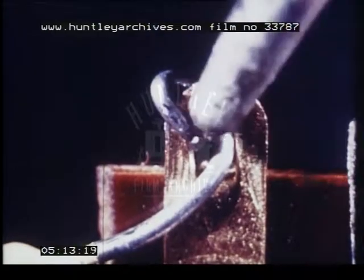If the component is moved while the solder is solidifying, a disturbed joint results. Such a joint is brittle. Air and moisture can penetrate between the solder and the component. In the course of time, such a joint will resist the flow of current.